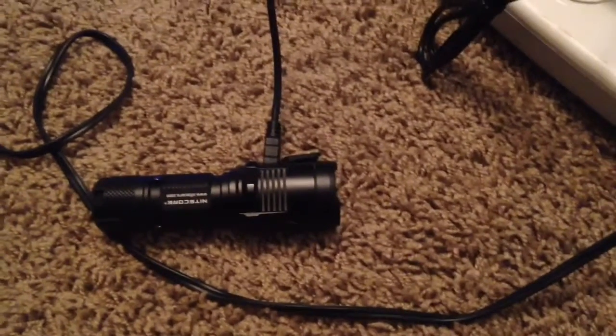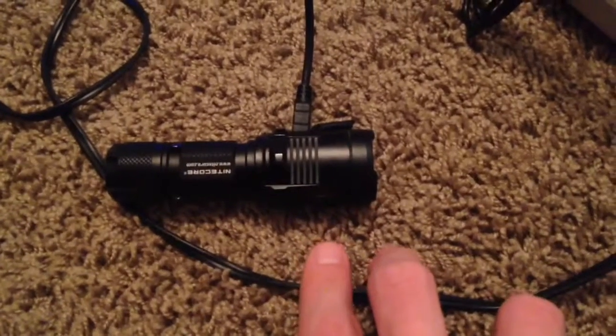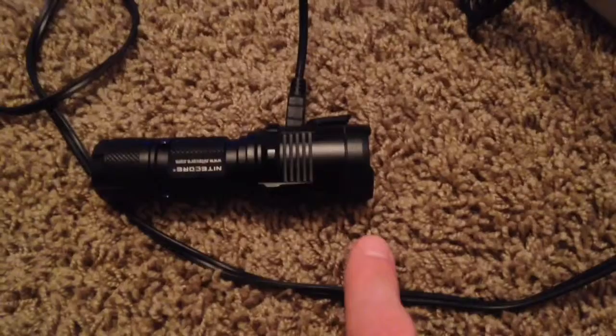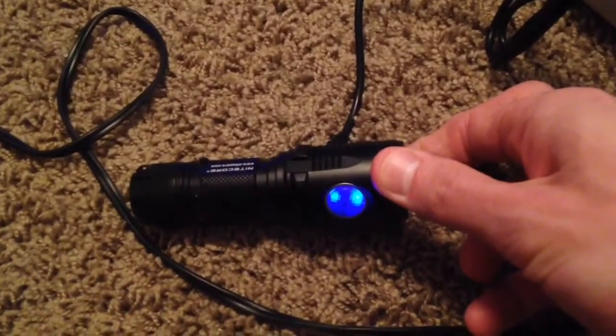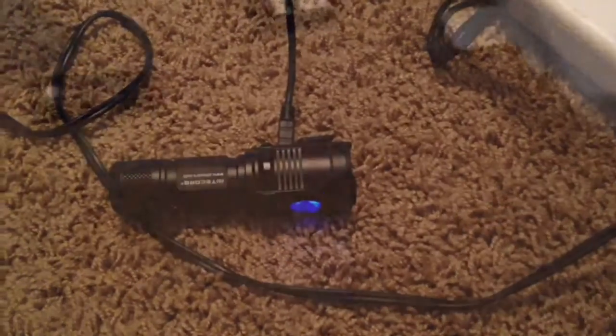Just keep an eye on your batteries. If you have a dead cell and your charger is not charging it because you've discharged it too much, just stick it in a flashlight with an integrated charge port and it should fix the problem. I'm actually surprised and shocked that it worked, but it does — so now you guys know.